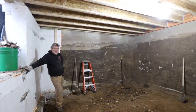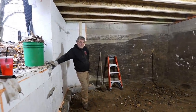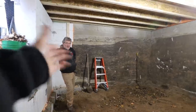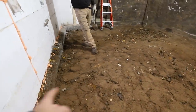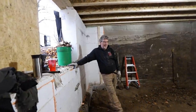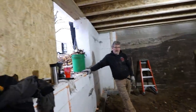Yeah. While we're down here, I thought I'd answer one question we got quite a lot when we were excavating around this water line, which was why we didn't move it to a different spot while we had it out there. And our general logic is if something ever happens to the water line, which is under here, under a footing, you're going to be digging out there anyway. So if anything happens to the water line, the current one will just become abandoned, and we'll put a new one in all the way out to the well. So you're going to be tearing up the yard anyway. Yep. If there's ever an issue.